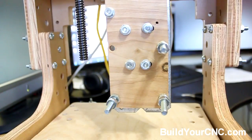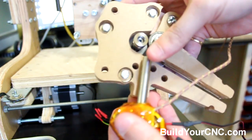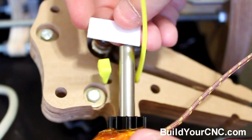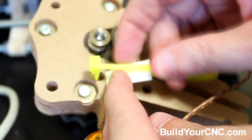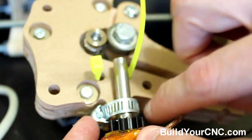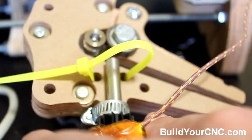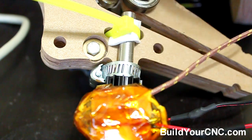Before we put this assembly onto the machine, we'll add the extruder to this assembly like so. Since this entire assembly is going to get rather hot, we'll be using the heat sink and some ceramic tape to insulate the tie that we'll be using — this is really just to hold the top of the assembly in place. Prior to doing that, we'll need to add the hose clamp onto this portion. You can see I shaped it as a rectangle so it will go around this portion, and this will also serve a little bit as a heat sink itself. Now we can screw or tighten the hose clamp using its worm drive screw.